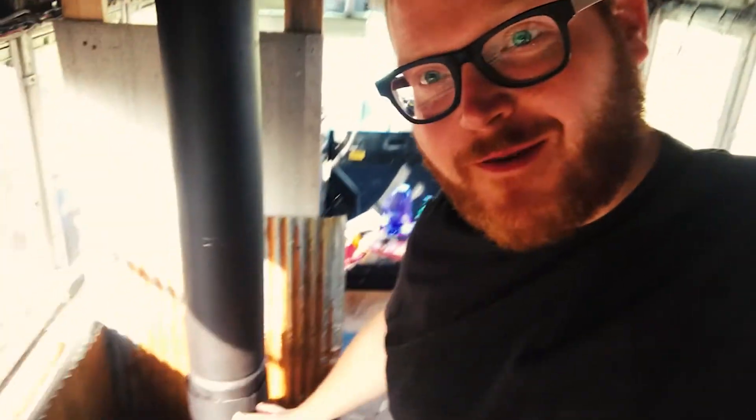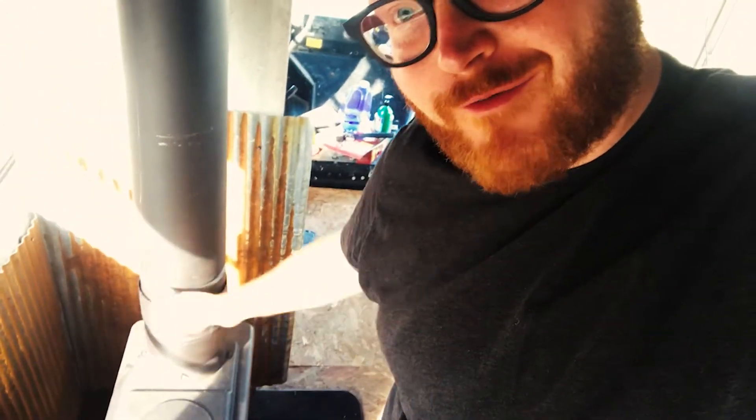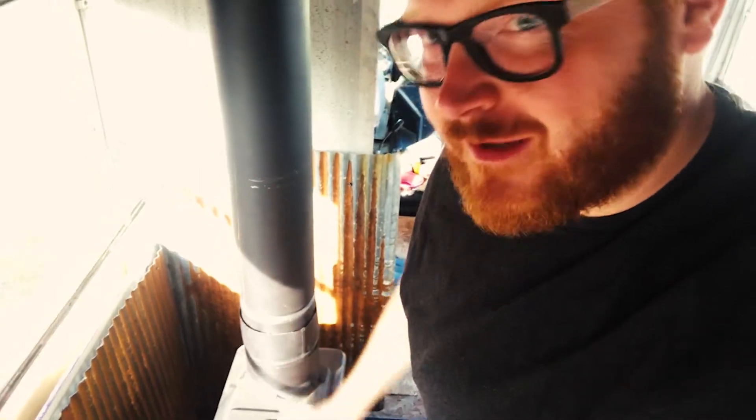I did a little research — turns out this stove is not exceptionally well made, which is shocking since it was the cheapest one I could find. Inside there are metal plates along the top that allow smoke to go up, around, and over, and then there is a piece of fiberglass wool on top that covers the whole top of the stove. The purpose, as I understand it, is that it traps the smoke inside the stove longer so the smoke is combusted — burnt up — and the exhaust that comes out of the chimney is much cleaner. That's why the stove is EPA certified.